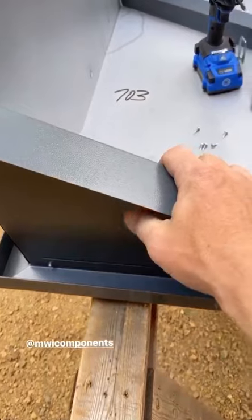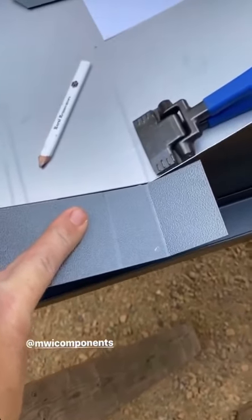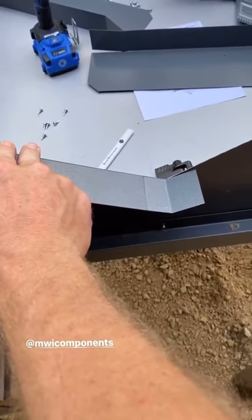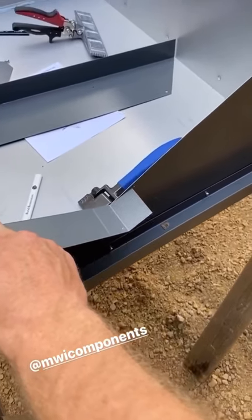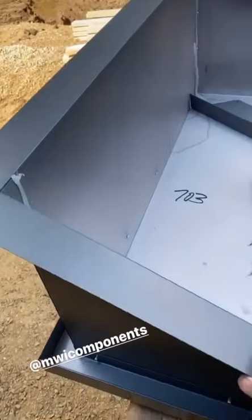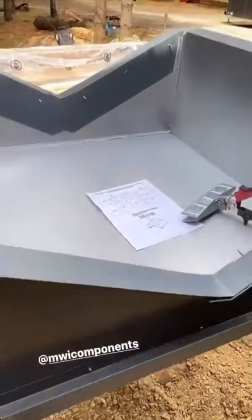Took this piece of flashing, you can see the old bend — re-bent it so that it's now going to be at the right pitch and the right dimension. The thing to remember is all of this gets covered up by our ridge cap, so we're not worried about any leakage. It's just good flashing practice and adds rigidity to this base. Just like that, we've got our 6/12 pitch and now we can flip it over.